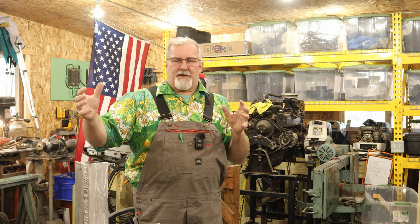Because the whole transom is strong. And quite frankly, if you spread it out a little further, when you go to turn and torque, that pressure is distributed out further. You get me? Now it has more leverage on the boat. The outboard doesn't have leverage over that transom. Think about it: the transom clamps are this far apart and you clamp it on your boat and you go to turn. Yeah, there might be some torque and twisting, but it's in an area this way. You spread that out, and now the outboard has less leverage, from a strength standpoint, to do damage to your transom.